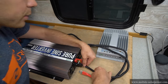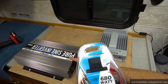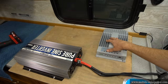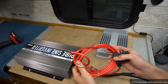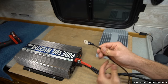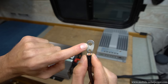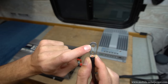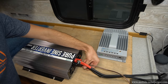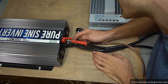Make sure that the red goes on the red and the black goes on the black. First let's put these connectors on the terminals for the inverter. This is what we're going to use to connect the solar charge controller to the inverter — it has pre-crimped connections, it's 8 gauge wire, and it comes with a 50 amp fuse which is the perfect size for a 40 amp solar charge controller. This is about 20 bucks at Walmart. One unforeseen issue: the hole was slightly too small for the inverter terminals, so I had to drill it out. When you look for an inverter wiring kit, make sure the hole will fit on the inverter terminal. Put this cable directly on the terminal, screw it down, and tighten it really well making sure all the connectors are flush with one another.